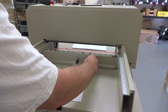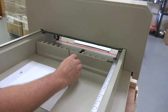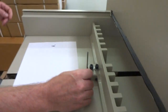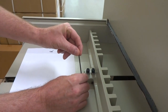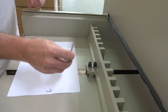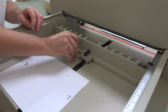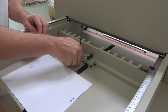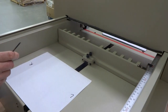First, loosen the bolts about a quarter turn each — maybe half if you want — using a 6mm hex wrench. Then take your 3mm hex wrench and make small turns, maybe just five degrees or so. Whatever you do to one side, you have to do the opposite on the other side. Once you move one side five degrees that way, tighten the other one down snug, which will move it about the same amount.